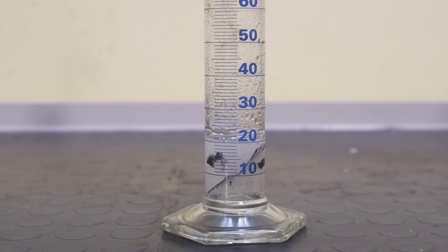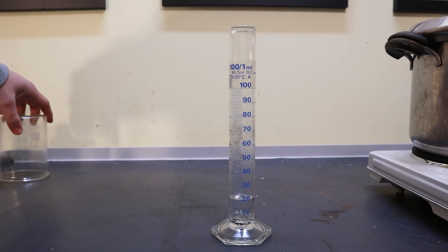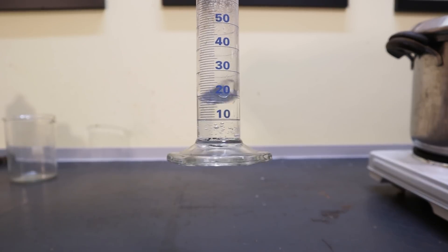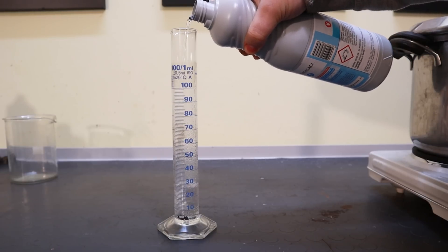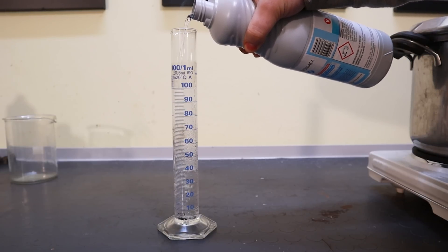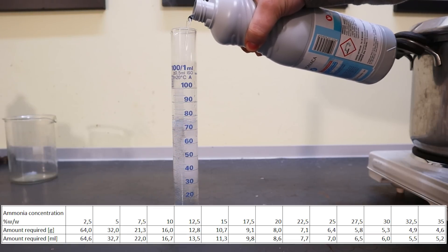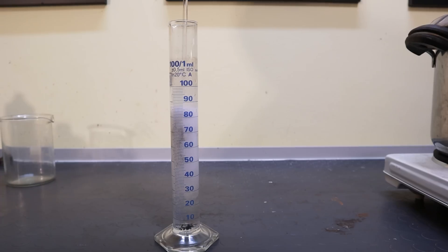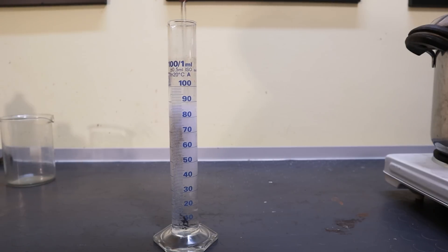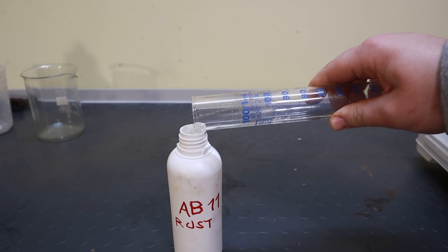What we've done is forming zinc chloride in solution. Now we have to add ammonia to form ammonium chloride. Ammonia is sold as a water solution in many different concentrations — it's not important as long as it's listed on the bottle and over 2%. We want to add 1.6 grams equivalent of pure ammonia; you can find the milliliters needed in the table depending on the concentration of your ammonia. Upon addition, you might see a white precipitate forming — that is normal and will dissolve upon stirring. Simply top the solution to 100 ml with distilled water, then bottle it in an airtight container.